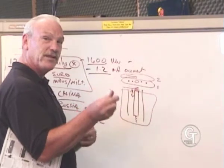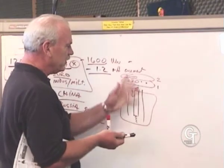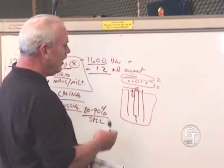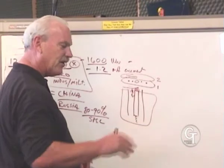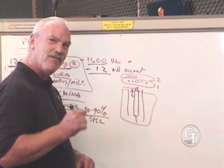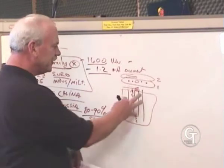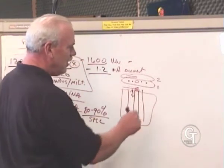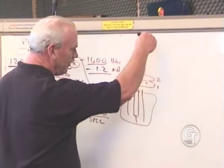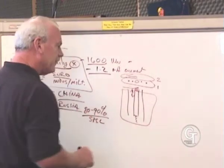It's the only preamp tube made like that, and it's also why it's so expensive to make — it requires more micas. Believe it or not, the most expensive part in making a tube is the mica. This is just wound wire or stamped little pieces of metal, but mica is a naturally occurring mineral that must be sliced very thin and stamped — and since it's rock, stamping tools must be very hard and durable, making mica stamping much more expensive than steel stamping. At any rate, it has three different micas: a bottom mica, a top mica, and what I'd call a top-hat mica which has the spring-loading effect on the cathode, keeping the tube very linear in its performance.